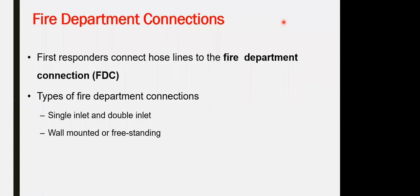Even if you are operating the network at a higher pressure. It was one of my cases: the operating pressure from the network was 8 bar or something for the high-rise building. The fire department connection is only connected for the fire truck. It doesn't have any operational function within the network itself. So it just has to withstand the pressure coming from the fire truck. The maximum pressure required is 7.5 bar. You don't need to go for a higher rating of the selection. Cost-wise, you don't need it. It is available, but you don't need it.